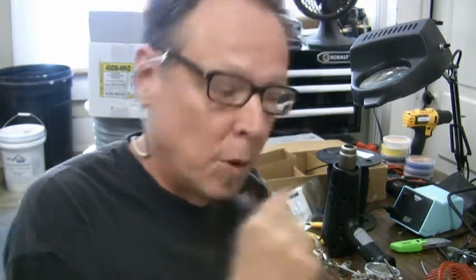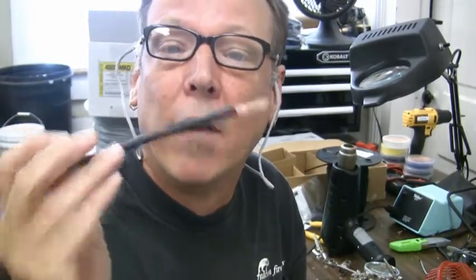If you have a bunch of small kinks in a long cable, it just means that cable is noisier and more prone to noise, including noise from stepping on it or somebody picking it up. Say it's on a handheld microphone and you're moving around with one of these cheaper cables, you're going to hear clicks and pops. With this served shield mic cable, you won't. It's impervious to that type of noise. That's the real difference between the three types of shields you have.